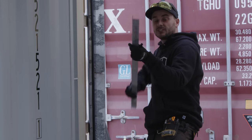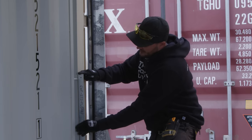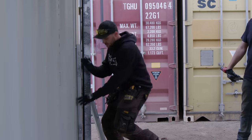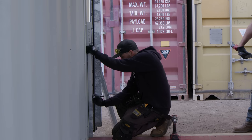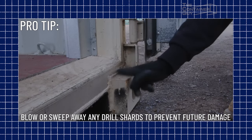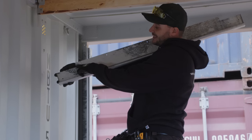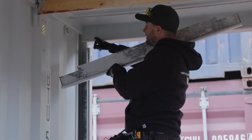One edge is longer than the other — the short face goes against the corner post, and you align the long face of the angle perfectly flush with the corner post. Once you get that in place, mark or center-punch your holes, drill them out, and then rivet or self-tapping screw it — whatever gets it secured. A little pro tip: blow or sweep away all the drill shards, because once those shards touch humidity they'll either pit right into your wood floor or begin rusting prematurely on all the steel members in your shipping container.